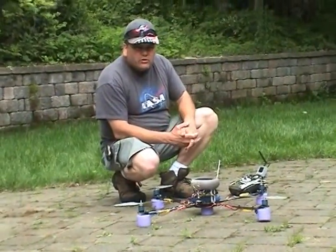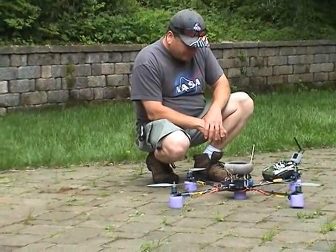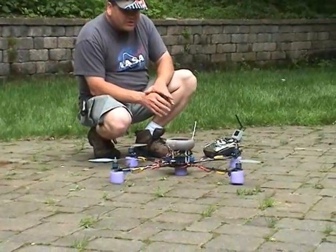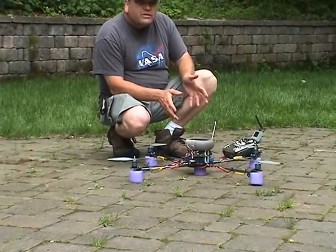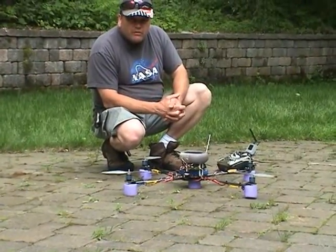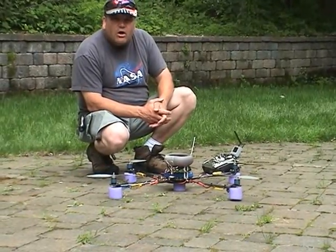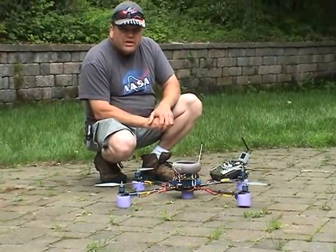This is a little video of a neutral stabilization test that I'm doing for a UAVX electronics controller mounted on a Rusty's frame. What I've done is I've zeroed out the compass value in the UAVX, set the P and the I values on the yaw, and the I value on both the pitch and the roll.